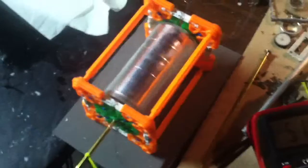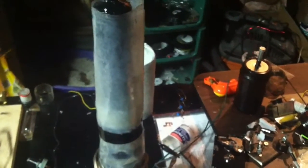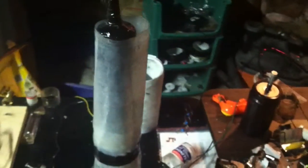Along with the electrostatic motor here, and making a brand new secondary and primary coil for a brand new actual Tesla coil. This one is all uglified because I basically overclocked it and ran it into the ground. And a little tip: don't ever use electrical tape, even if you're only dealing with like 5 KV. I thought it would help and not hinder me, but I was incorrect. I created carbonization from arc-over, which made a conductive layer on the secondary. But I will scrap it and recycle it — I'm green like that.